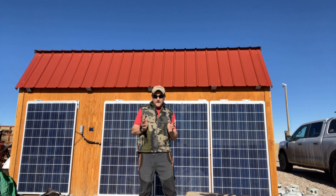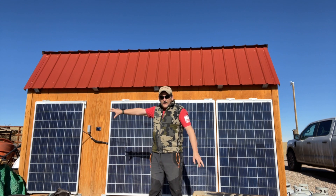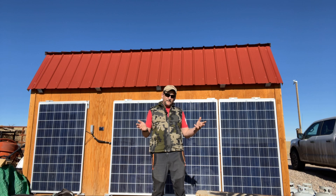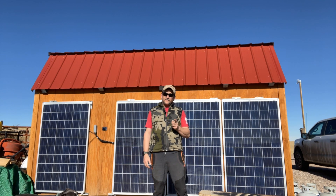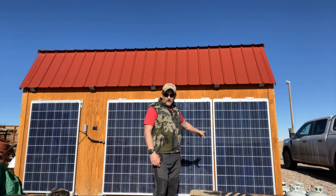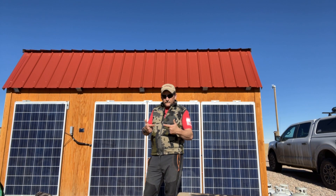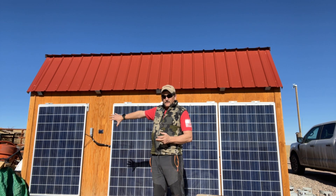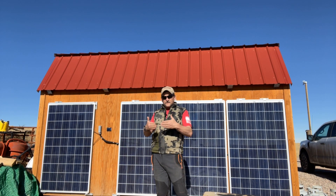With that first demo, because I have these two in series and these two in series, my amperage was never cut below maybe 50% — we went from 20-some amps down to 10 amps. But now what I've done is unplugged these two solar panels, so all we have are these two hooked up in series with no parallel connection. I want to show you how devastating shadowing is when you have just your panels in series and nothing in parallel to help supplement that.